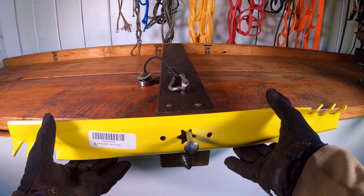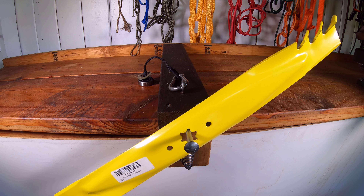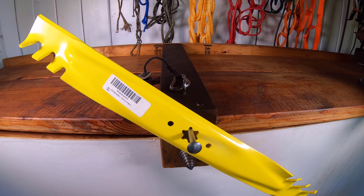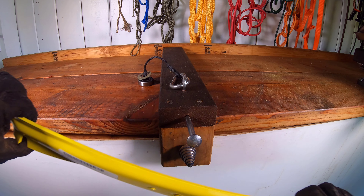Balancing the blade on the carriage bolt with the round head is shown because it would be the equivalent to balancing the blade with a nail in the wall or a nail in the bench vise. This would be the most common and most cost effective way to balance. With consideration to blades with star pattern mounting holes, they would be balanced on opposite sides.